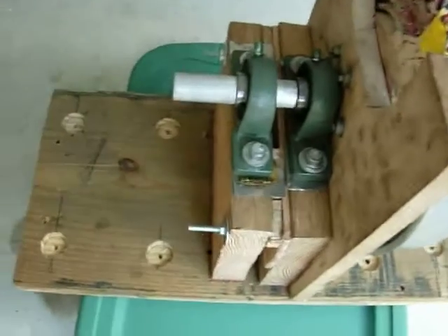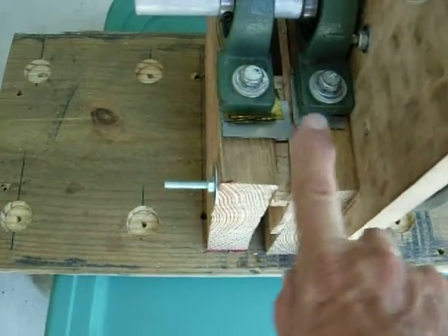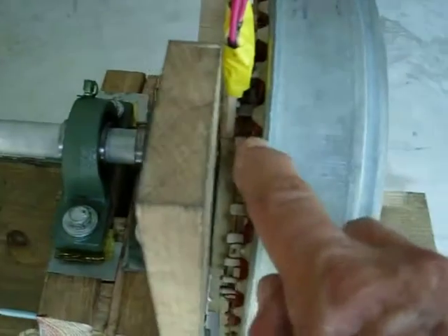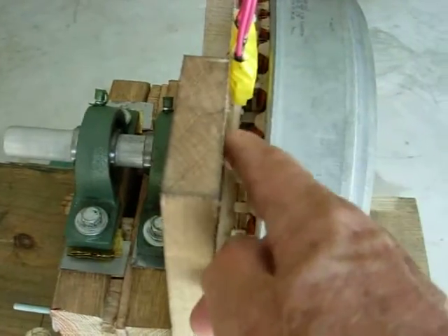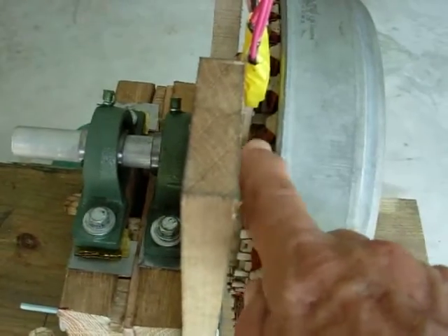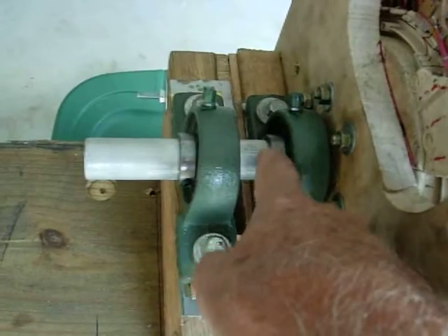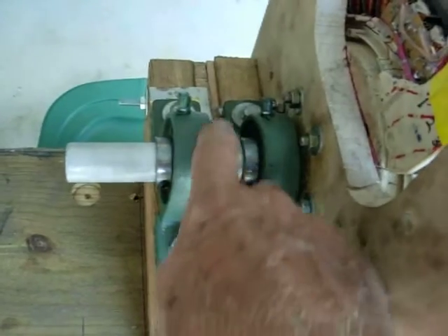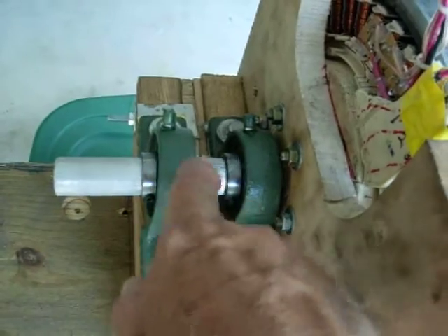The next thing I did — I completed the motor. I had to use a bolt here to tie these two pillow block supports to the vertical piece. You bring the rotor surface right up to this surface first without the stator on it, and make sure these two surfaces are at a perfect right angle. You also want to make sure that your bearings can spin by hand. Once that's all done, tighten down this whole assembly, check the bearings again, make sure they spin freely, then tighten and pull the rotor out.